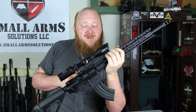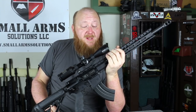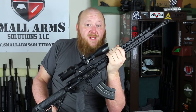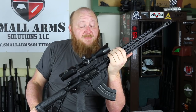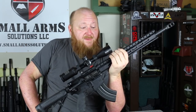With a standard timed barrel nut, you really don't know where you're going to end up, because you've got to go 35 foot-pounds, check alignment, then keep going — up to 80 or even 100 foot-pounds — to get the gas tube to fit. Traditionally, mil-spec goes 35 to 80 foot-pounds. At Colt, we didn't realize until we got an automated torquing machine that for many years the rifles were exceeding that spec, because you couldn't tell — you'd torque it and then adjust wherever needed to align the barrel nut for the gas tube.